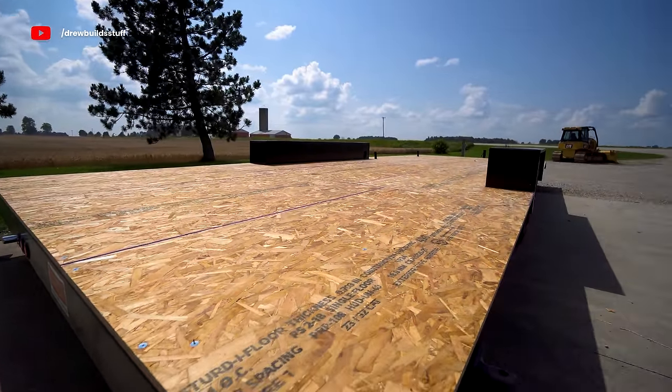Around the corner, I just used another chunk of that same piece of 2x4 so the color matches, and glued it onto that edge and screwed it into the wall. After this gets a light sanding in a later step, you'll barely even see this seam. Then I just ripped a thinner section of 2x4 and used a 1/8 inch roundover bit in my router just to soften that square edge.